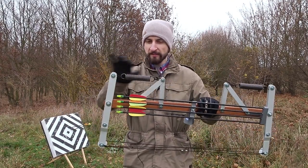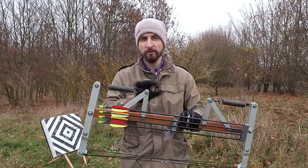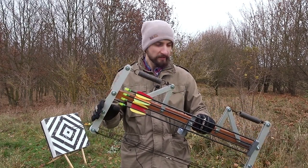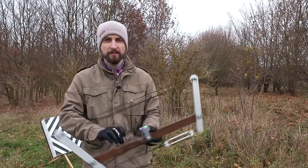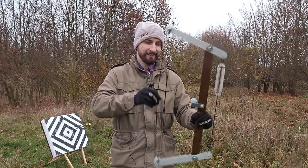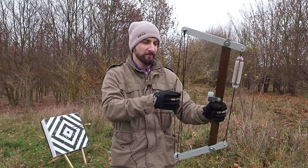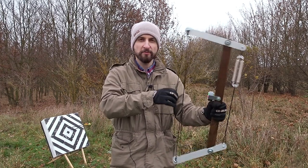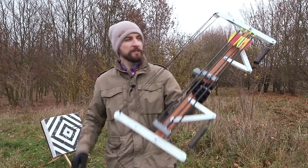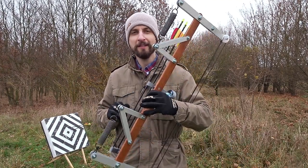Also, you will notice that this part here looks quite different because I separated the two springs. They're no longer connected anymore. So one spring powers one lever, essentially, or one arm. And that is because in the old one, there was this issue with this parallelogram effect. So that the center point here shifts off the central axis. And yeah, that's really not ideal. So for that reason I separated this, and also I think it looks a bit cooler.